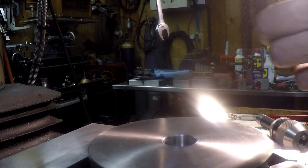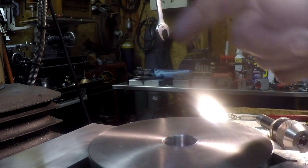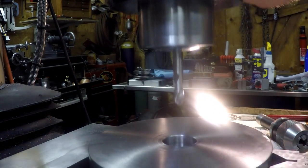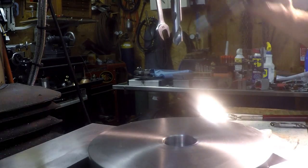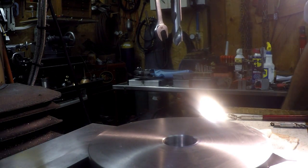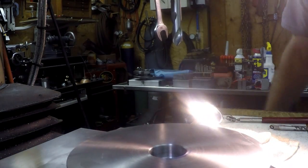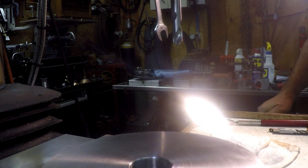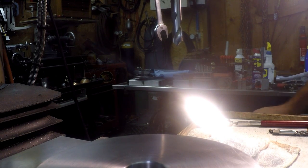Since I had a quarter-inch collet in there, I just put the quarter-inch spotting drill in the collet. I've got enough stroke so we're just going to use that for spotting it, and then I'll put a chuck in. Going over here to hole number one.